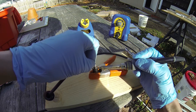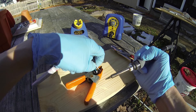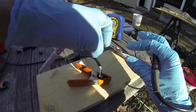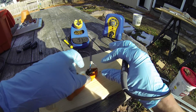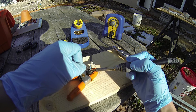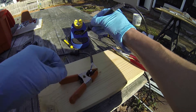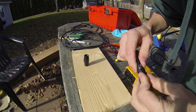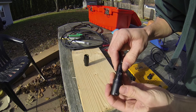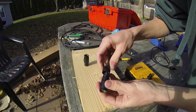Make sure you get enough solder in there. It can be a little tricky to hold the wires in place while soldering. Make sure you clean your tip after each time you solder. The solder joints should look nice and smooth. Once you're done you can put the connectors together.